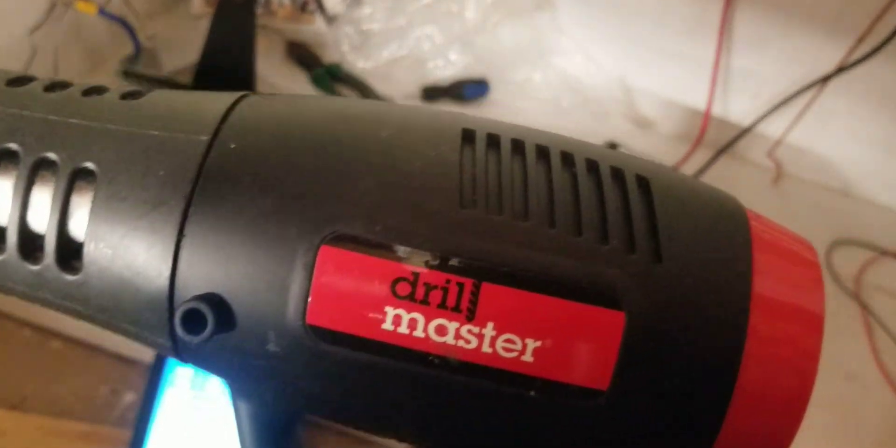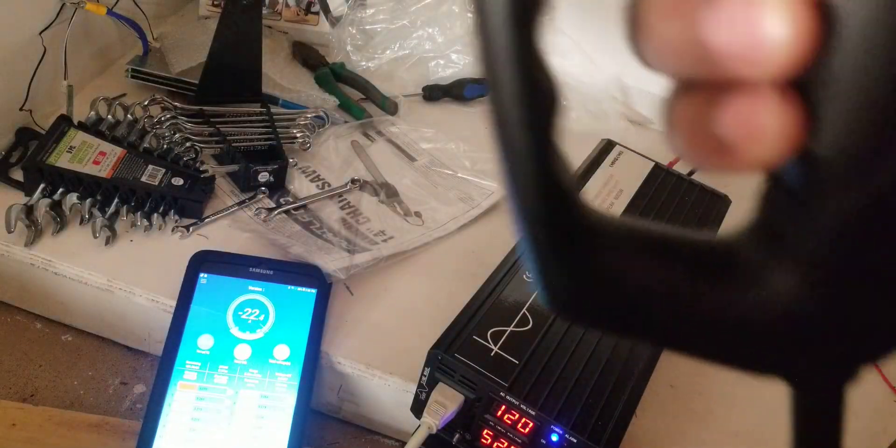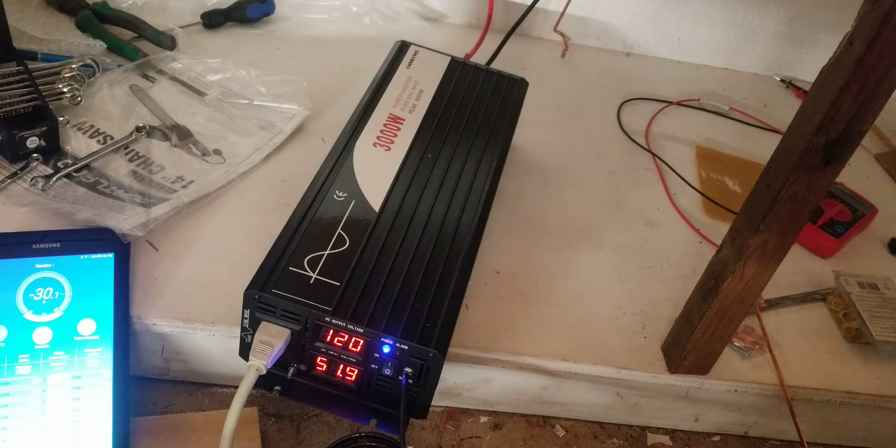Let's do the test one more time. I'm going to turn the heat down again, starting low and pressing to go higher. At 22 amps now — bring it higher — reached 30 amps, there we go. At 30 amps it shut itself off. Let's see: one minute fifteen seconds — for a supposed 2000-watt inverter it should run continuously. There we go — it shut itself down again. That's the deal — it shut itself down.